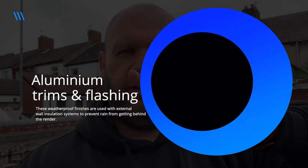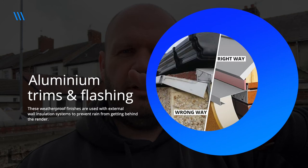It's a bit of a design fault - it's not installed properly, because the top of the insulation render should be angled so that the water can run away. A lot of times we find it's more straight, so the water's got nowhere to go. And if that bead of silicone between the brick and the top of the cover has deteriorated, there's nothing stopping the water running backwards - you've got like a wet sponge on your brickwork.